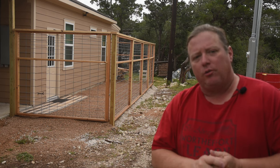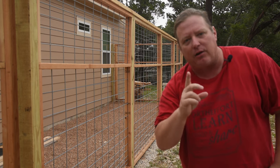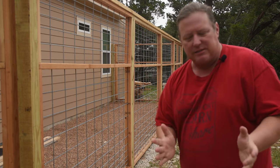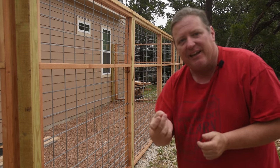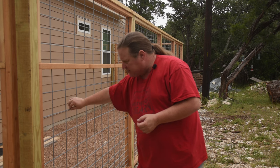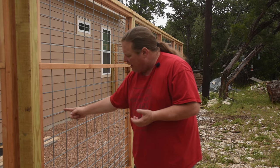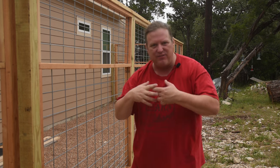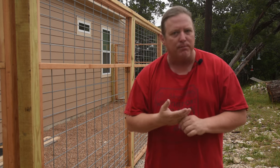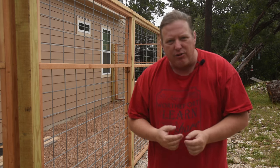One of the few things I probably would do differently now that I've done it once: doing these panels consistently worked out great. I only had one panel which I had to adjust in the setup, because I was using those jigs to place it. That third one down, the jigs wouldn't work because this wasn't perfectly plumb. It actually was only about an inch off, which meant I had to cut these right here. So these extensions are kind of weak. If I had to do it all over again, I would not cut these right next to the bar. I would maybe come out an inch, a half inch, and leave that there to slide that part in the ends. That's a short enough distance that it'd be very unlikely for it to bend over time, and it would give you even more error proofing in that you could trim them back a little bit if you needed to.